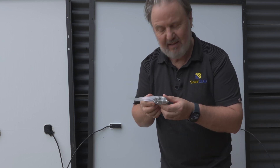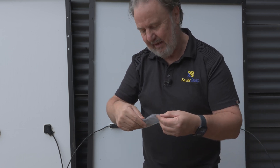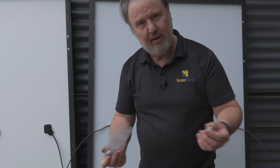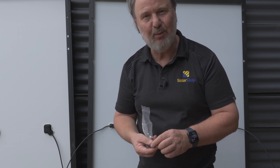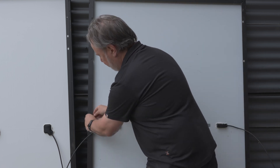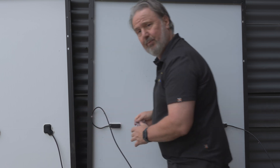Got the lolly bag here — awesome little clips. These clips are for securing the cables to the back of a module. Proper cable support is important. You don't want your cables lying on the roof where they're exposed to mechanical damage from abrasion or from blowing around in the wind. Also, you just want to look good. These are a great solution. We can support the cables here by putting the clip on and attaching the cable — piece of cake.